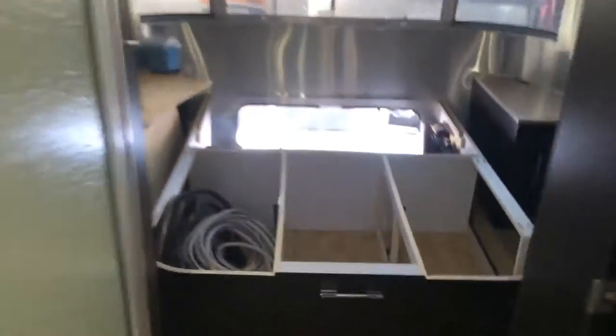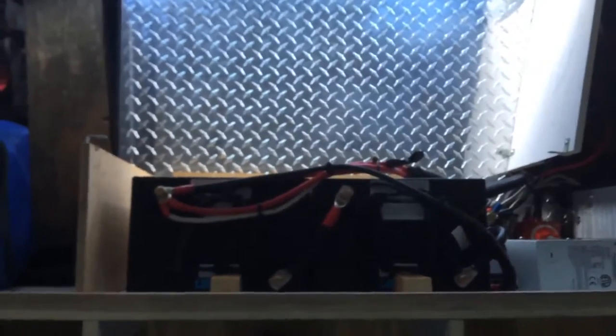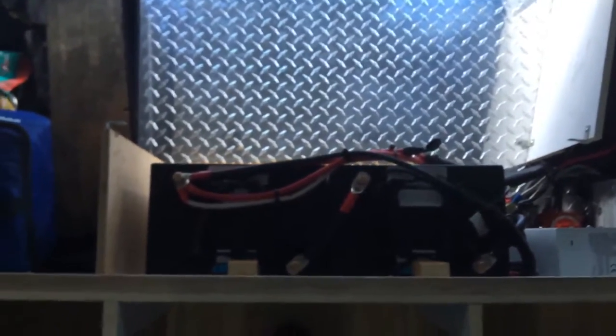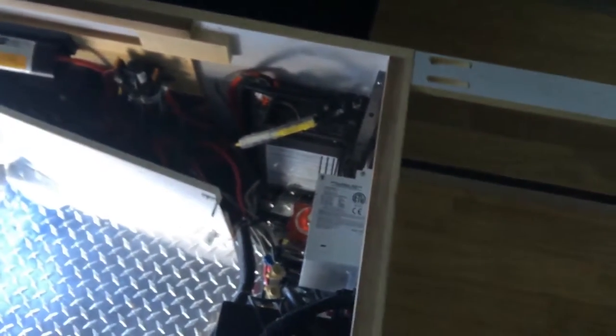Walked down into the front bedroom. We still got the bed apart just like we saw before. This is the front storage. There's the two 6-volt AGM batteries — 300 amp hours total, 150 usable. All the old Airstream electronics. He had a 600-watt inverter he's going to stay with for now.